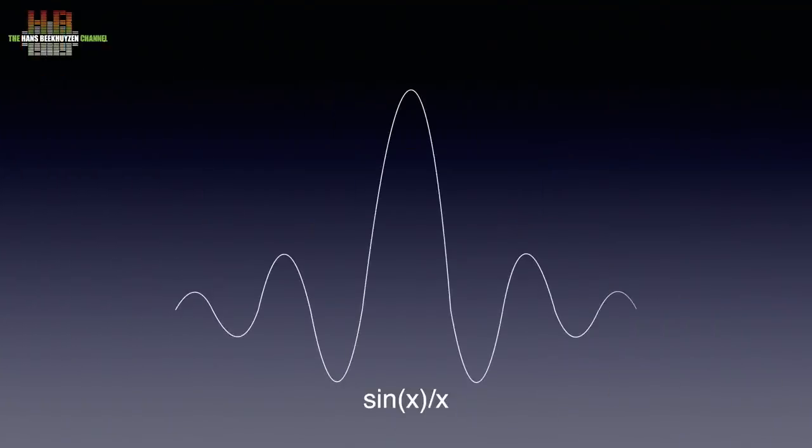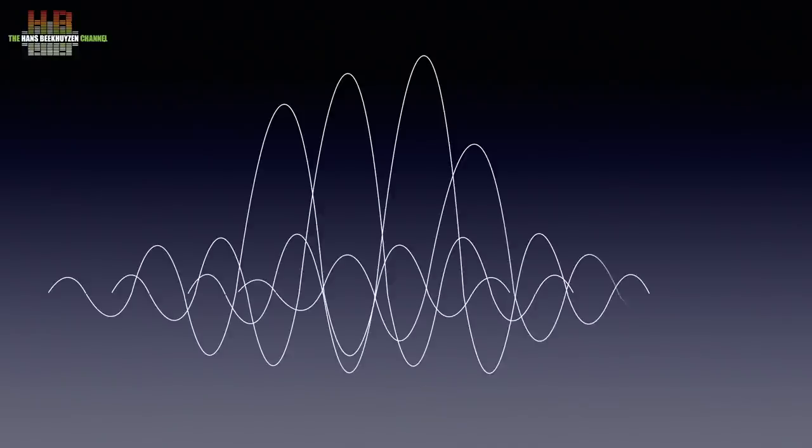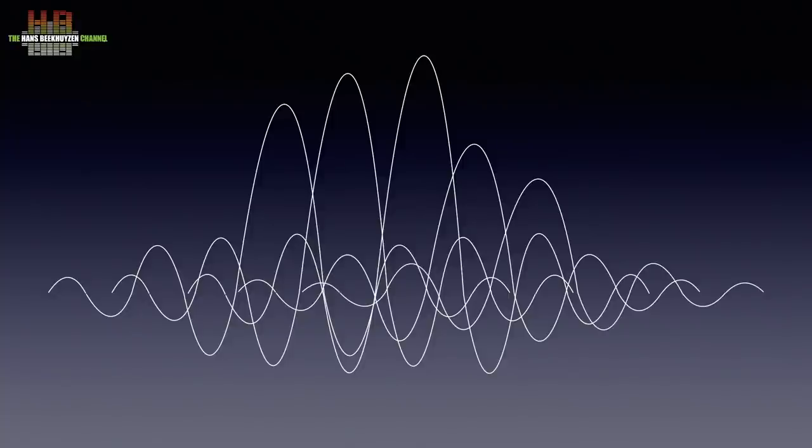The WTA filter works differently. It uses a so-called SINC X-over-X signal. If you reconstruct the signal from SINC impulse responses, where the central peak equals the sampled value, you in fact increase the time resolution since the inter-sample level is the sum of the signal in between the sampling points. And the more SINC impulses used, the higher the time resolution. Again, this is a very simplified explanation.